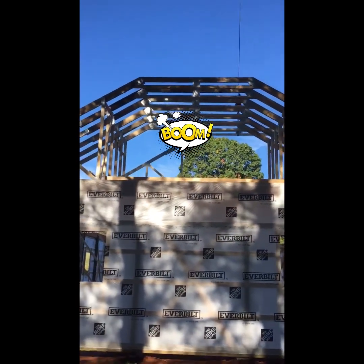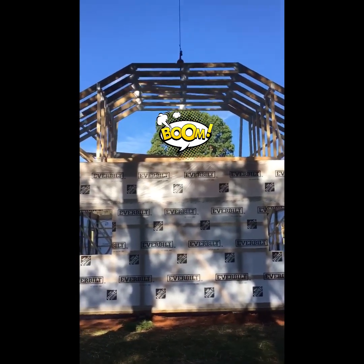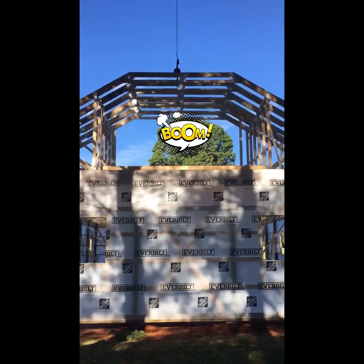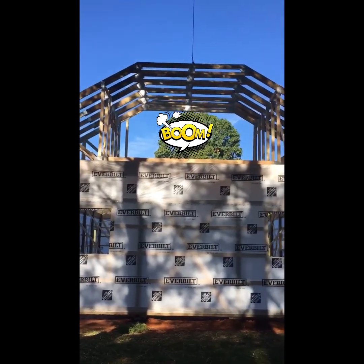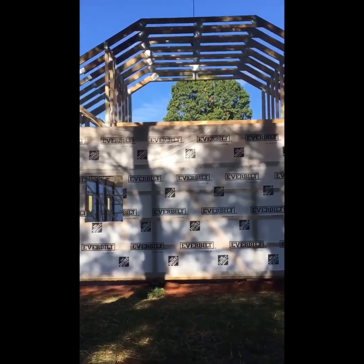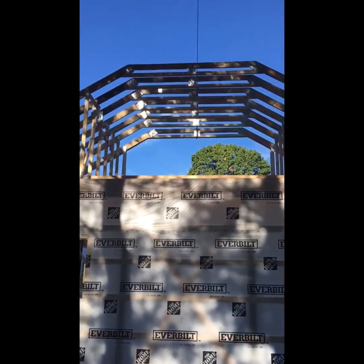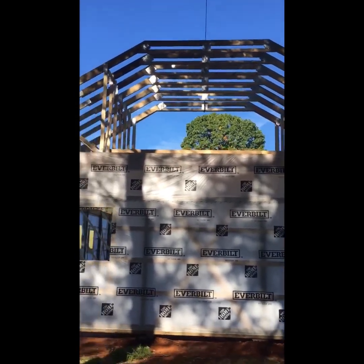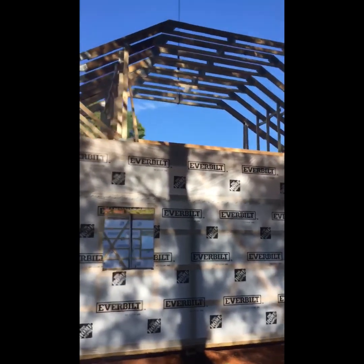One more thing — you can see how it's flat at the top of the trusses. My trusses are way too tall. I've got 13-foot high trusses. So they had to cut the tops off to get them down the road and put a piggyback truss on to complete the A-frame. I didn't want to pay for extra shipping, so we went ahead and piggybacked them.